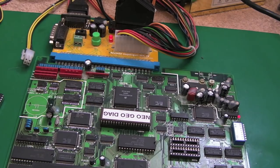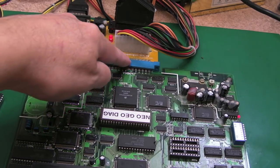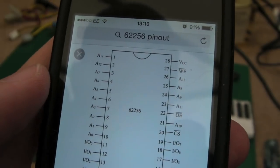I've got it all connected and powered up. I'm using a cheaper Arcade Super Gun, mark 4 ATX power supply, SCART cable going to the TV. There's no video RAM in there at all at the moment, and it's not detecting it — I'm guessing it gets stuck on the first error it encounters. I'll stick a couple of 5814 chips in there — the RCX ones or the Sony ones — just to populate them. We might get a problem with the VRAM yet. I think the next thing I'll do is try and focus on the backup RAM issue.